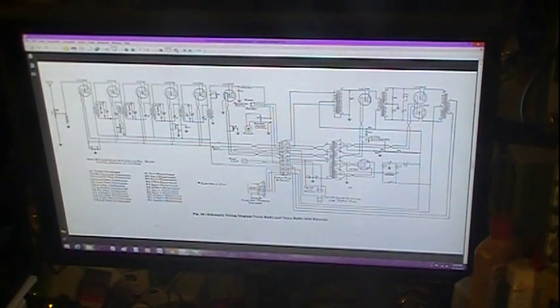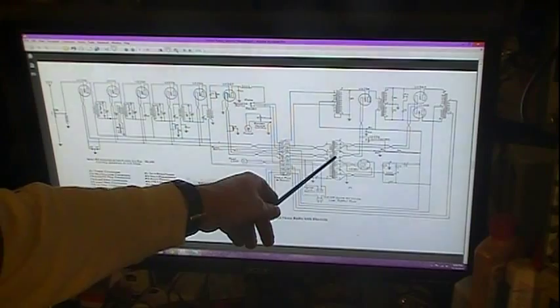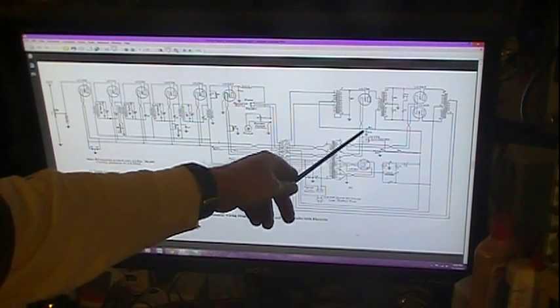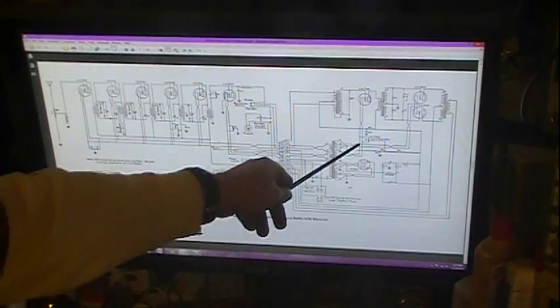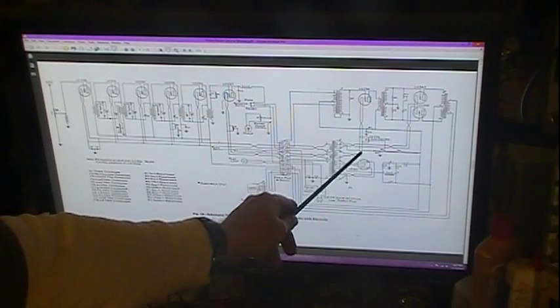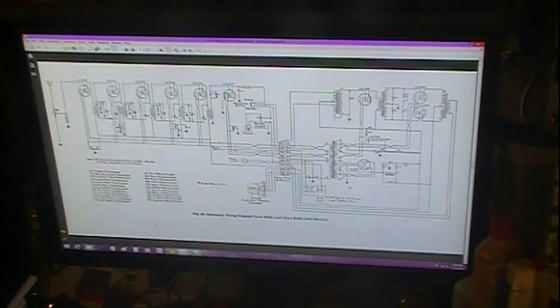Well, the two 1.5 volts is fine. And why do I need those? This has a separate hum control circuit. This is actually a completely separate circuit, with a separate hum control that they're controlling. Trying to put that in with the rest of these guys would not be a very good thing. Plus you also have RF on this side, audio frequency on this side. These are the cathodes. This is directly heated. So you would like to try to keep those separate.